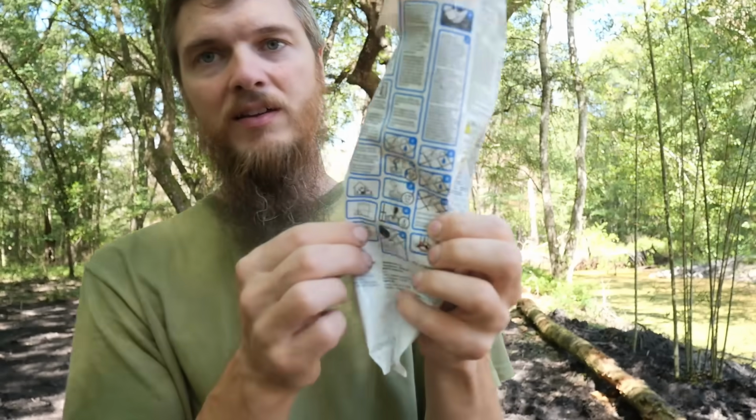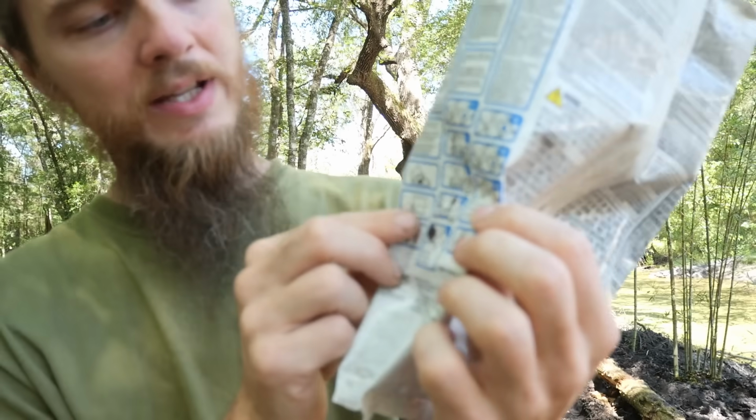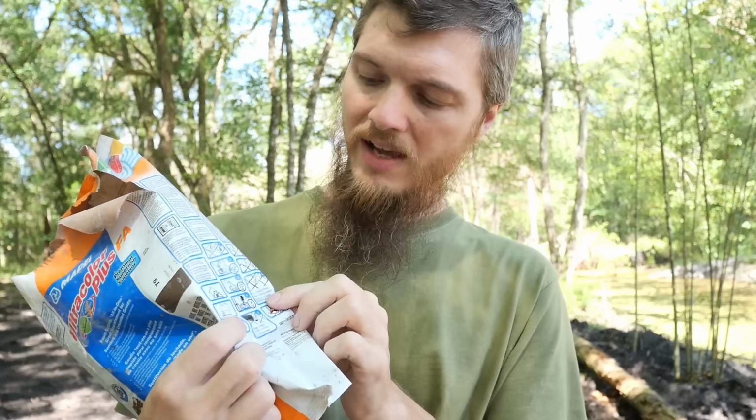So that is the biggest tip I can give you guys. Don't use a drill, hand mix it. I bet that is exactly what went wrong. That is the difference between our first job and second job. The first one good, the second one bad. And that's exactly what the manufacturer told me, is you must have used a high-speed mixer, because that makes it set up very fast when you whip too much air into the mix. I don't know why it does that, but interesting. So that's what happened.